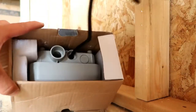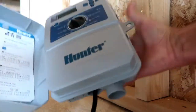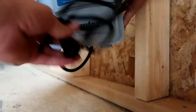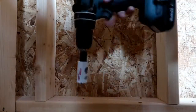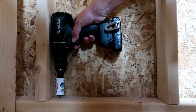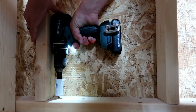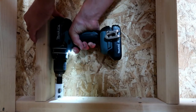You have your main controller box, a power source, and your wires for your sprinklers. In this situation, it comes with a cord, so we need to find an outlet to plug that into. This particular install will be done in a backyard shed. The best way to route the wires for the sprinkler valves was up through the floor of the shed. Here, I'm drilling out the floor with a hole saw for our conduit to go through.